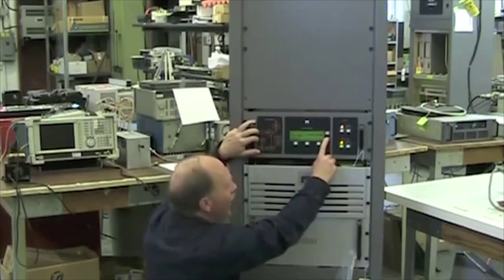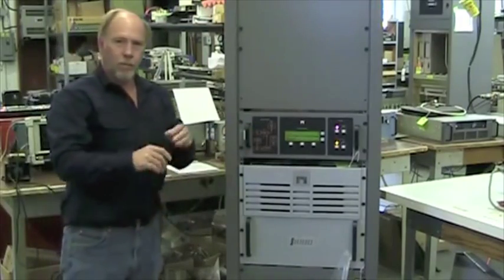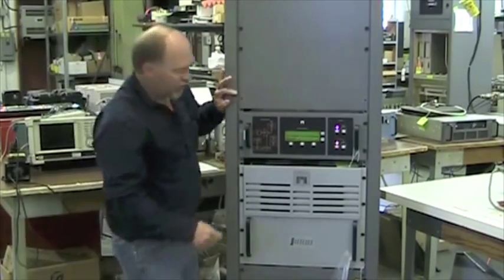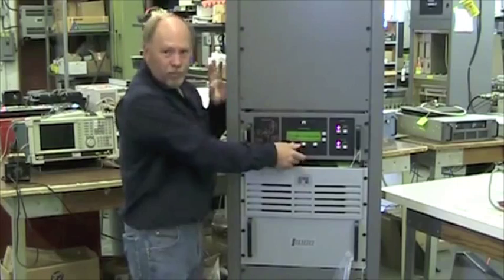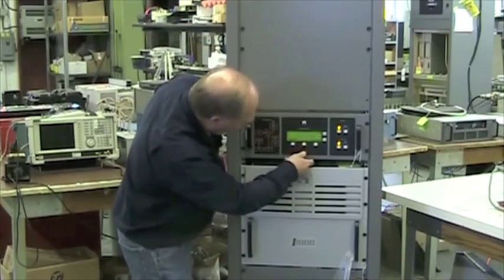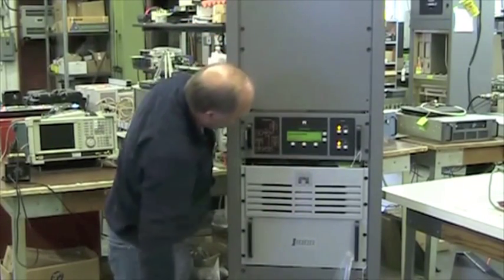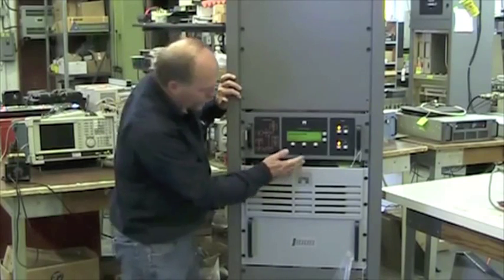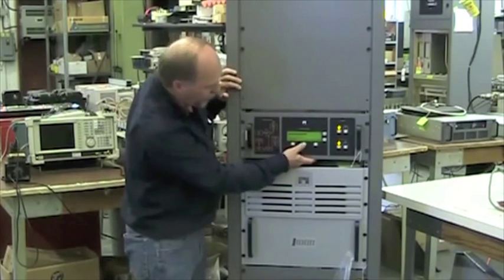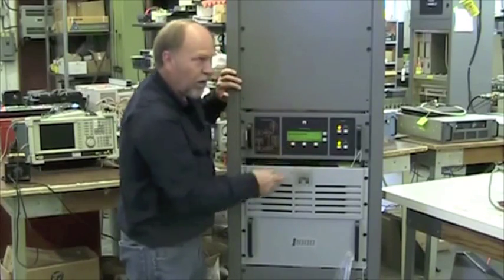The next one is the factory settings, which I was actually referring to, that you shouldn't go in this menu unless advised by Nautel. Changes in here can disrupt the operation of the transmitter. Select, and I'll give you a warning. Press yes. First menu is the calibrate meters. I'm not going to go through each one of them. They are what they are.